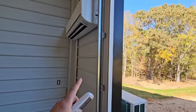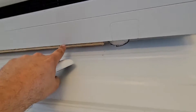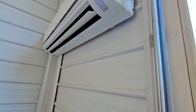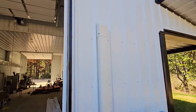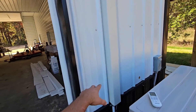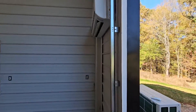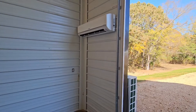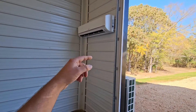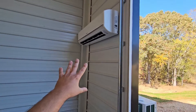This is the indoor unit. Since we have this metal ridged corrugated metal here, we added a piece of plywood. You can see the line sets and the drain go right through this PVC and through the wall. The line sets run on the outside of the building, covered with line hide that matches the exterior metal. The reason we didn't run them inside the wall is because the line sets for this three-ton unit are hard to bend — it's five-eighths tubing. I don't want a rough-in box with this and I don't want any water inside the wall. It's okay to use a rough-in box with smaller mini splits, but with three-ton units I do not.